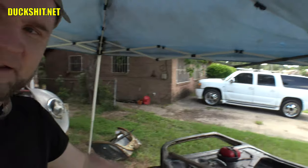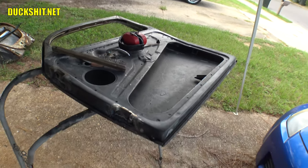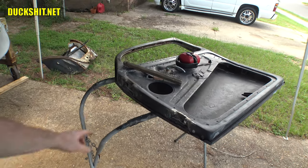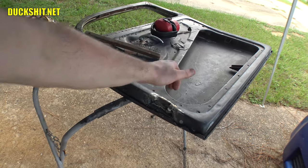We're back today with my 1956 Beetle. Yes, and I'm not working on any one thing specific. Today, we're actually just doing a bunch of welding around different spots, and you can see I've already gotten myself kind of dirty because I've been poking around up inside of the door here, doing some of the welding to this guy. This door and these hinges need to be finished and finalized. And, well, it was a matter of just filling in all the little holes around the area and getting these little boxes welded in from the backside.